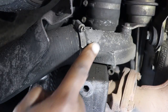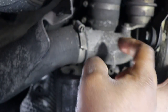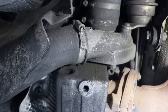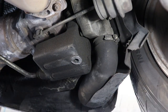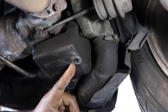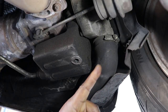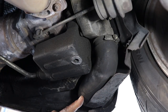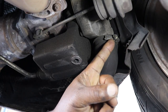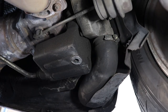It's coming from the turbo going to the intercooler, just like that. You would take this hose clamp off and put your plug in here, then pressurize up to the Y pipe. On the left, driver's side in the U.S., here's the little oil reservoir for the turbo, and right here is the pipe going to the intercooler. Here's the hose clamp you'd take loose to pressurize or plug — doesn't matter which side you put it on. Now you've seen left and right.